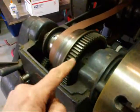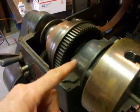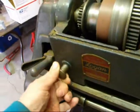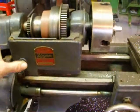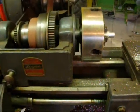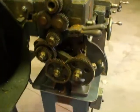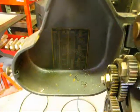Here we have the back gears and the bull pin, which isn't going to show well. When we disconnect the bull pin and put the back gears in, that is done on a Logan lathe with this slide here rather than a lever like you see on some machines. This entire assembly is called the headstock, and we've got the bearings in here. This lathe does not have a quick change gearbox, so we have the gear train here and some of those we would have to change. Inside of here is the chart telling you how to change the gears.